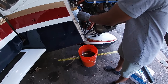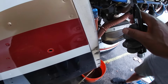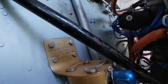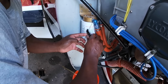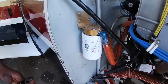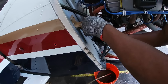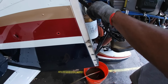So here's what you can do. I'll let you do it. You can simply just fish this behind there, and just cut the wire. Oh, so that cutter's down at the bottom. So you can try to get it in between. Yeah, just cut that. There you go. Oh wow. So now it's unsafetied. And with this one, what I usually do is I'll just reach up here and cut that. And then that's broken. We're good to go.